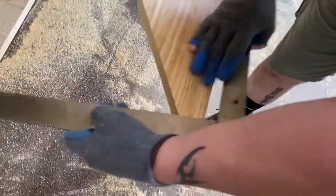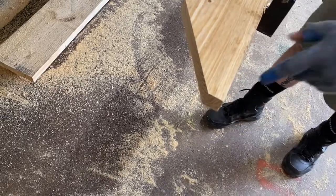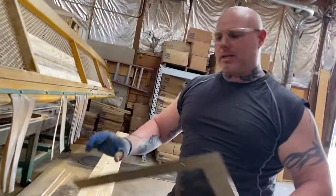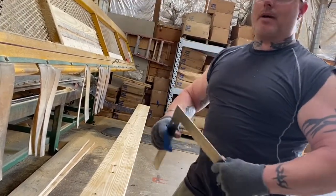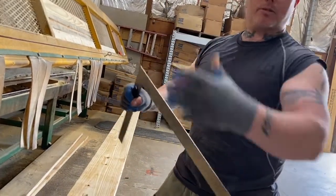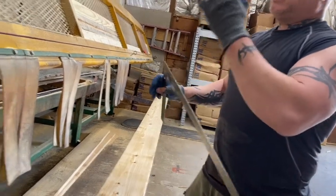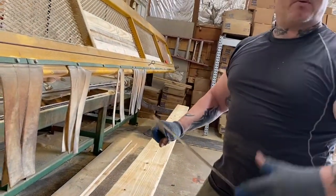I'm a little low on my heel, so I'll go back and adjust accordingly so it matches. Once I get everything lined up, it usually takes one run through, then I'll calibrate it to be perfect. If I have 60 of them, I'll run 30, then stop and check that nothing's moved. It is a machine, and things do happen, but very rarely. Then I'll check it again. Perfect, I'll run the rest of them through.